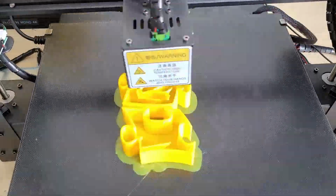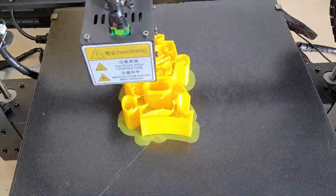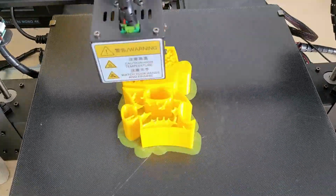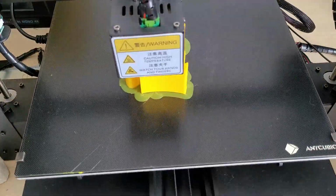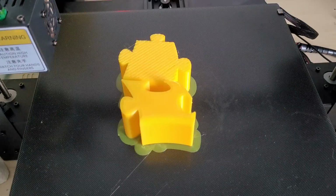Using Cura, I then sliced the pieces at 0.3 mm height using 40% lightning infill for the non-structural pieces, as you can see in the video, and 50% cubic infill for the structural pieces. The structural pieces are those that hold large screws like the neck pocket, the floating bridge assembly, and the six bridge screws.